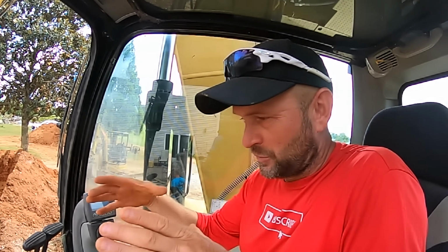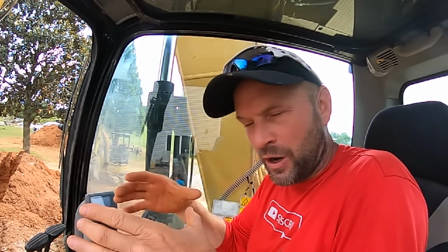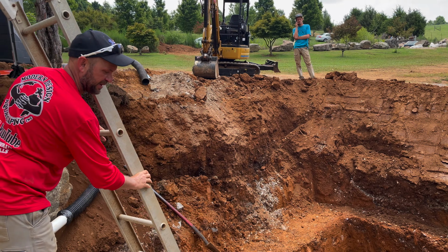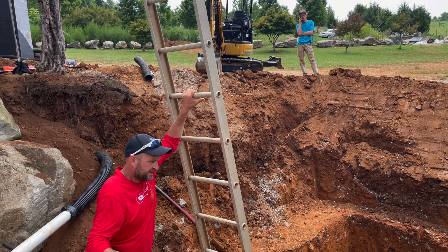Excavation here for our reservoir. We like to have an extra 12 inches of space so that the blocks can be out of square a little bit or however that's going on, but we ended up changing the angles of our digger. We did something different and we've only got an extra 6 inches.